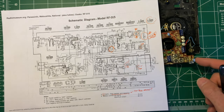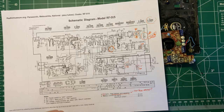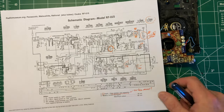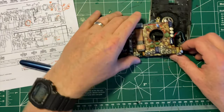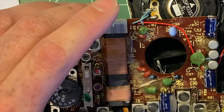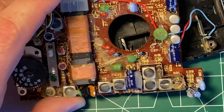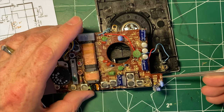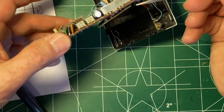I'm going to desolder one end of this and take it out if I'm going to anyway. I will say, along with a nice schematic, this board is brilliantly marked — everything is labeled. You can see C28 and here we get C25, R25, and R22, which are surface-mount components. I should show you the back of the board — the back has surface-mount components. I was wondering where the transistors were until I realized each of these is a surface-mount transistor.